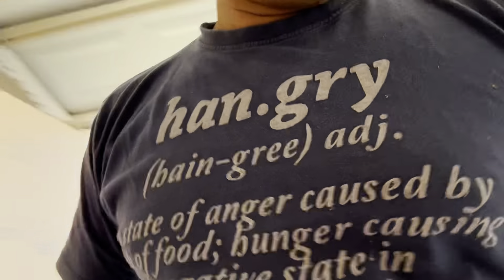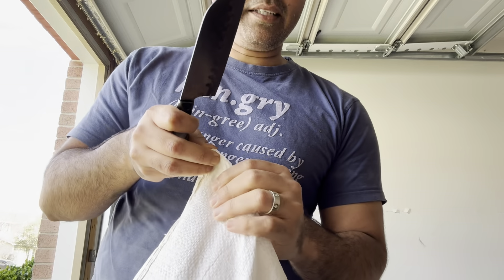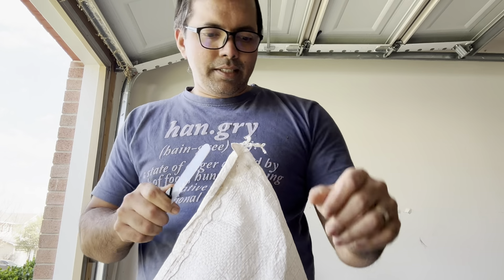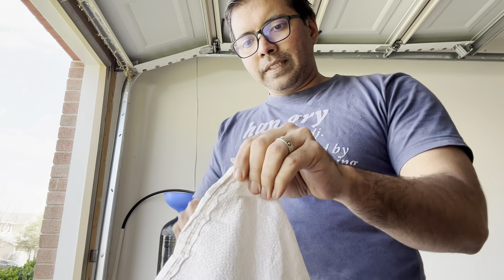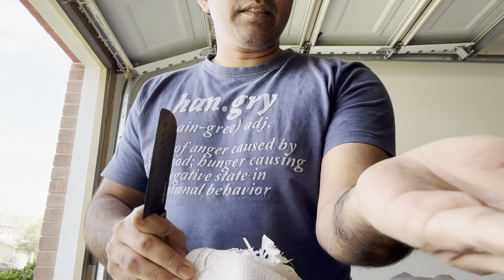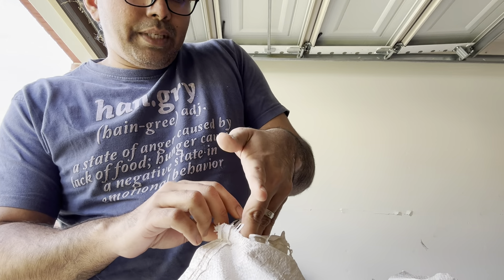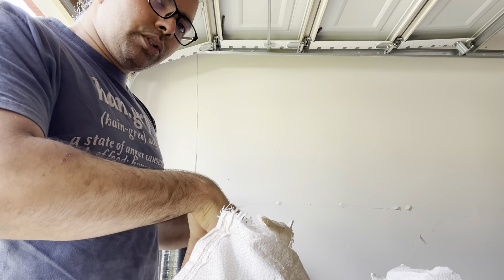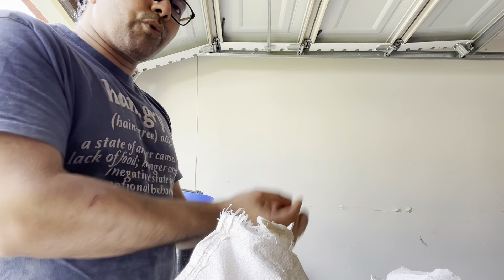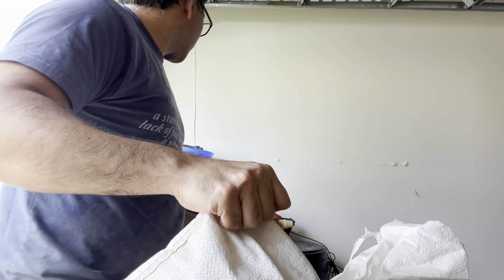Let me place my phone somewhere so I can show you how this whole thing works. Here's the gravel — basically just rocks, but they help filter the water. The operation is: water comes in, goes through the resin, through the gravel, and from under the pipe the soft water comes back out into your house. That's basically it.